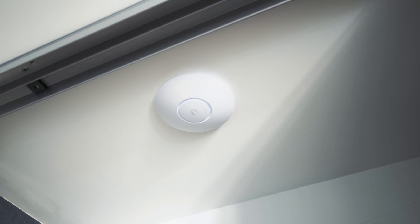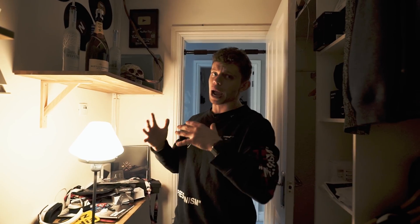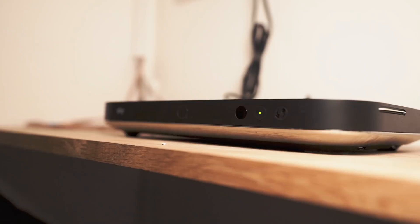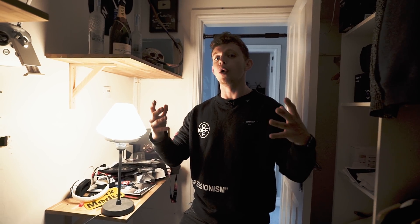This house is essentially an L-shape, so I've worked out that three access points give me pretty much 5GHz coverage in every single room including the garage, and also out in the garden because of the mesh AP out on the outhouse. In here we have the Nano HD — it's hidden behind a wardrobe over there. Moving on to access point number two, this is providing coverage to the right-hand side of the house via an InWall Pro access point. I really like this access point because it has Ethernet ports on the bottom so you can plug in a different device. We have a SkyQ box plugged into it here in the UK, receiving internet access through the access point which is also giving us Wi-Fi.